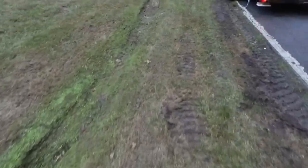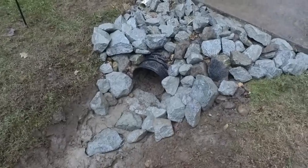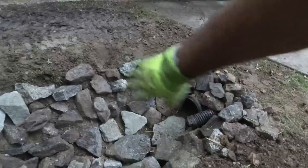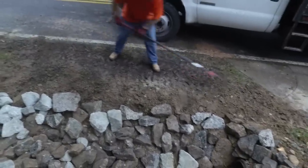We are finished with this job. Corey just reworked where this irrigation line was in here and the homeowner just came out and looked at it and she's real happy with that. We've got our outfall right here and we've got our inlet right here. We tried to keep the inlet real open with some flat rocks that will hopefully let the water go right in there, and then all this riprap up here is meant to slow the water down, so the water slows down and then it makes its way into the pipe, as opposed to washing over here real quickly and overwhelming and going over the driveway like it used to do. We're just trying to clean up a little bit before the rain really starts.